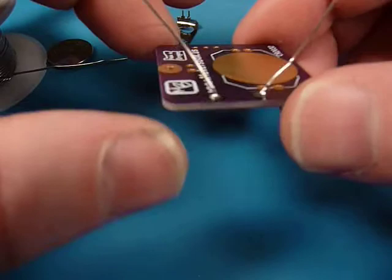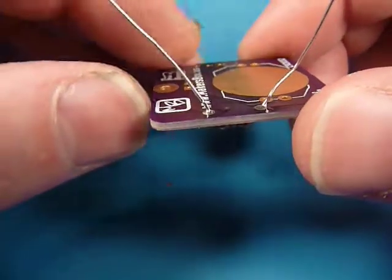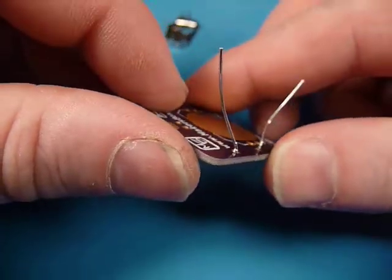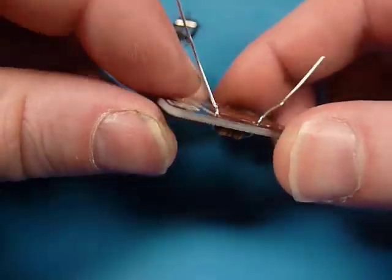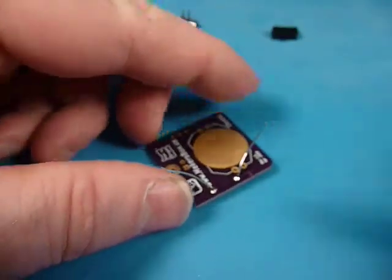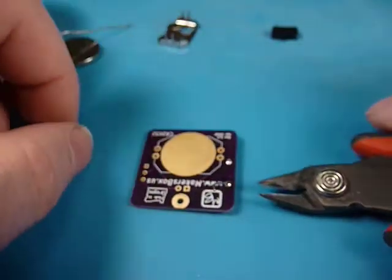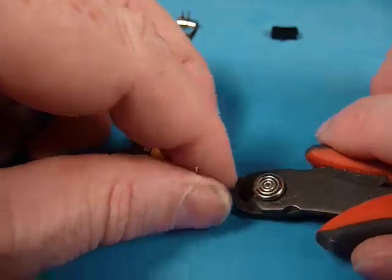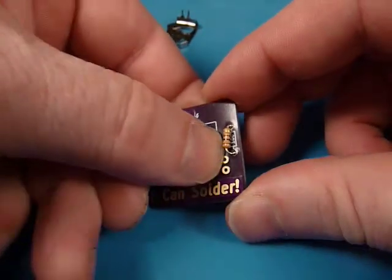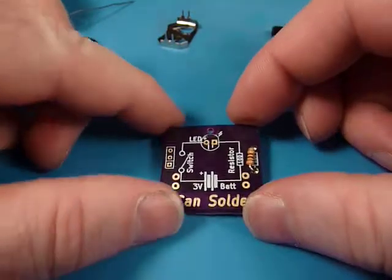I tell people, if you see it soak in, it'll tent in — you'll see it's just kind of magic. This one here doesn't have quite enough solder on it, but we'll fix that later. And you'll see this one's got a little bit too much solder — a little bit of both cases. Then we're going to use our flush cut pliers to trim those off as close as we can to the board. I didn't quite get that resistor perfect, but nothing's perfect, so we'll live with it.